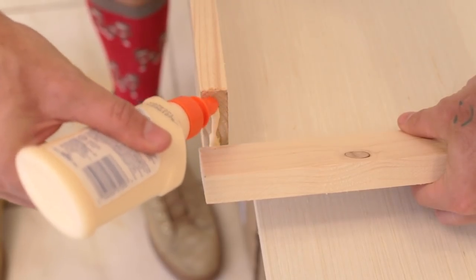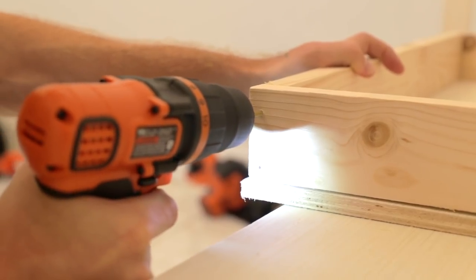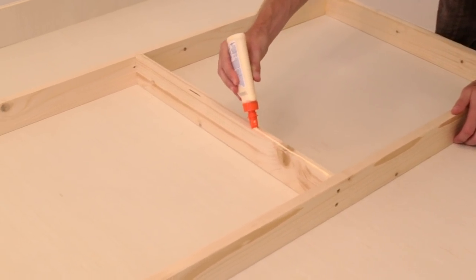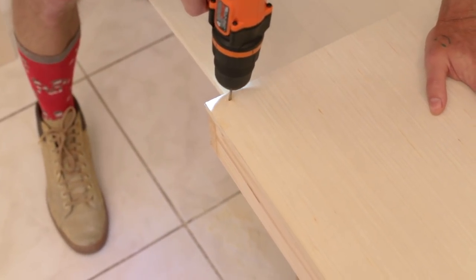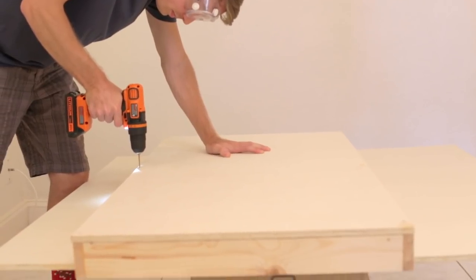You want to make sure to pre-drill your holes before inserting the screws so the wood doesn't splinter. A little wood glue here helps make it a solid bond. We used two 1-5/8 inch exterior screws to attach them. Once the frames were built, we applied wood glue all around the top, then lined up the plywood. We used the same screws to attach it, making sure to pre-drill and countersink the screws so we could putty and sand for a smooth finish.